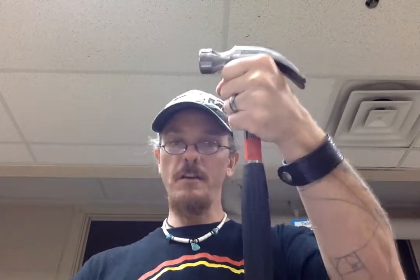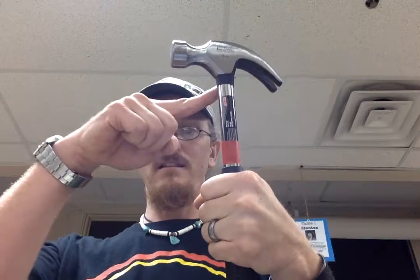The grip that we use is right here in the middle. Once we get our nail started at the top, we use our grip here at the middle for our hard driving in of nails. This gives you a balance of control and power. Right here in the middle, this is the swing that will do what we need to do with the hammers. Now, hammers are a safety goggles tool. You've got to wear the safety goggles if you're using the hammer. That way, if the claw comes back and hits, it'll hit the goggles, not your face.